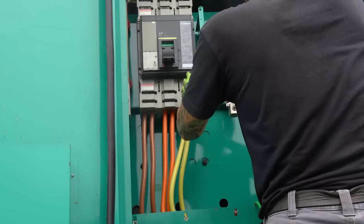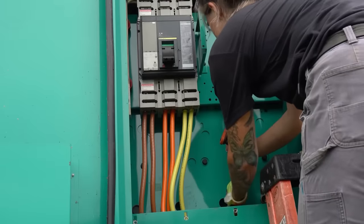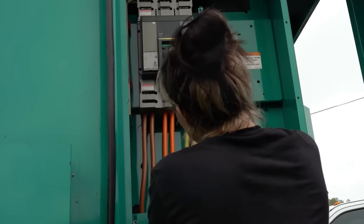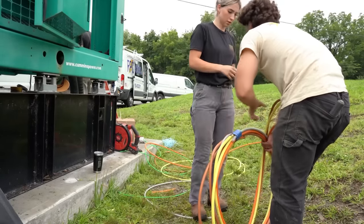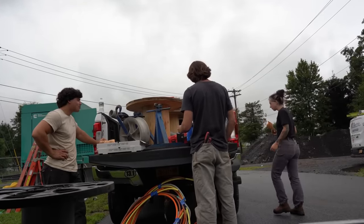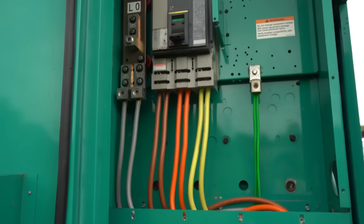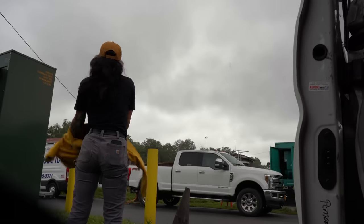Thank god my company got the actual color-coded wires in for this system. In the earlier job we don't have a color-coded system and it's also 277/480, so I'm going to have to phase tape the hell out of those wires. It saved me a lot of time that we already had the right color scheme wires on site — plus it was raining so I don't know how well phase tape would have stayed. I'm a perfectionist so those yellow wires were not doing it for me. I basically torque them down a little bit, then move them to the position I want, then torque them to the lug spec so they're not going anywhere — and yes, I did re-tighten after moving them. These are the scrap wires — we taped them all together and I feel like I did a pretty neat job.